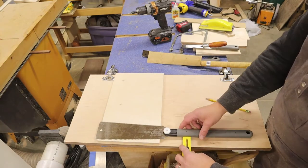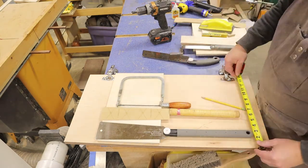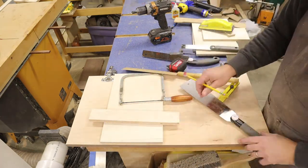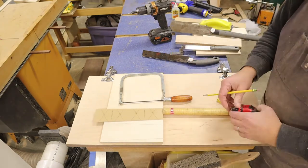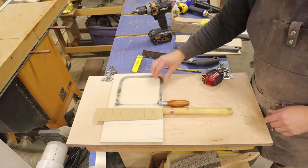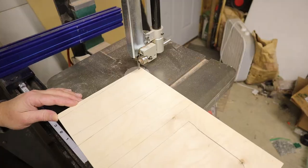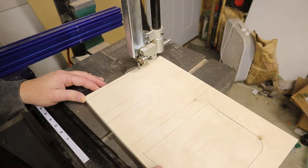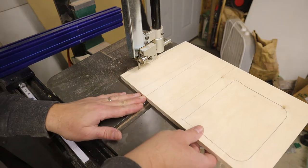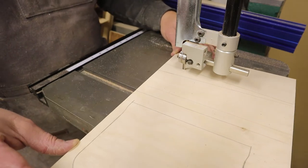This was my favorite part of the customizing process. I had one cabinet that held most of my hand tools, and I wanted to put all my saws on the inside of the door when I opened it up. I thought it'd be really cool to see how many I could get on there, make it easy to access, and have it look really nice. I started with a half-inch piece of Baltic birch that would fit on the inside of the door, then laid out all my saws on that board to see how many would fit. After tracing out the saws, I took it over to my bandsaw and cut out pieces that I would glue onto a second piece of Baltic birch. I made sure to take my time and go nice and easy to get all of those angles right.